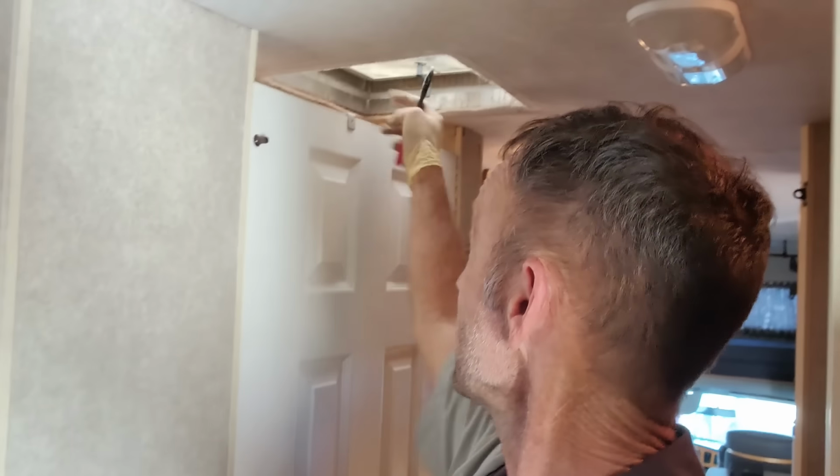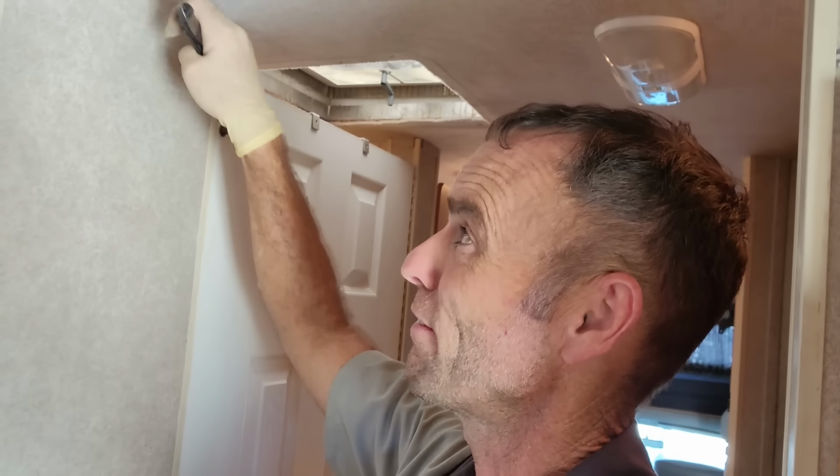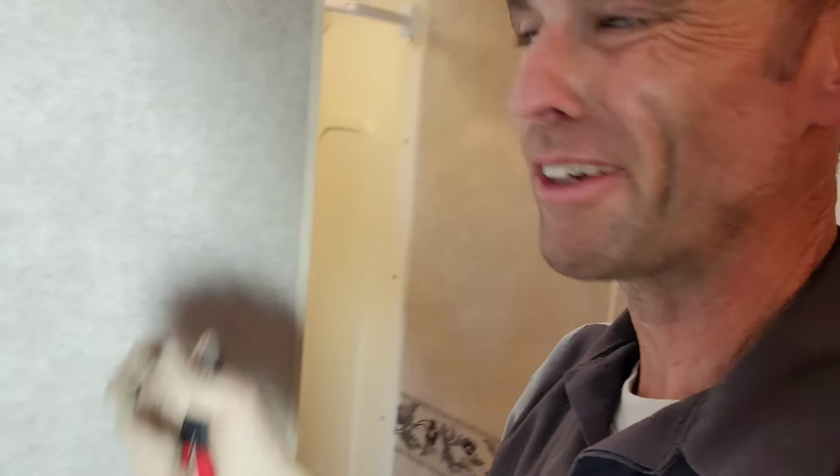I'm going to try to pull this wall right here. I think there is space. I should be able to run through the styrofoam, through the header of this wall right here, and I can pull this paneling back, drill a hole, and it should be pretty hollow, so I should be able to pull the wiring down and put the thermostat right about there, a comfortable in between, where I get room temperature. So let me do that.